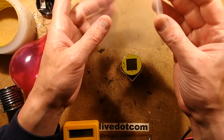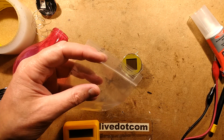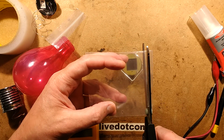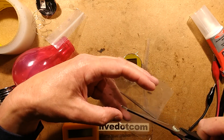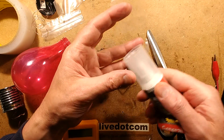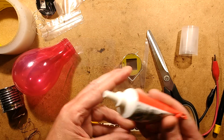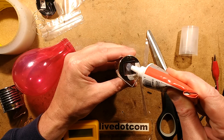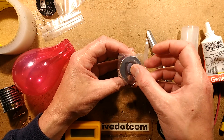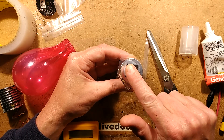My technique for putting this on is to get a piece of polythene — that slippery plastic. In the case of these polythene bags, they're the ones that immediately avalanche off your workbench because they slide against each other very well. So I'm going to cut a piece of the polythene from this bag, a suitably sized piece like this. And what I'm going to do is squirt some of the silicon sealant — this is the acid curing stuff, it's the easiest stuff to get — put a good generous blob, about the size of a large pea, into the middle of that. Then place the polythene layer over the top to protect your fingers and just squish it about to spread it so it overlaps the solar panel and goes onto the plastic at the side.